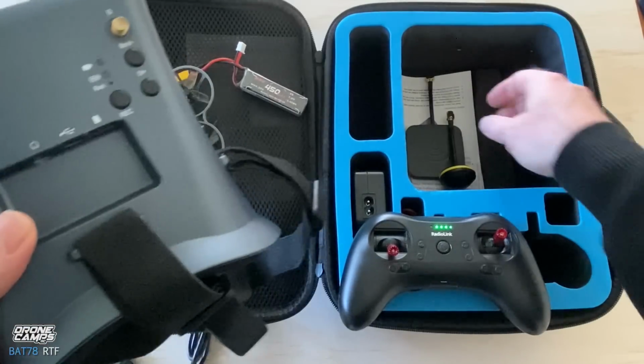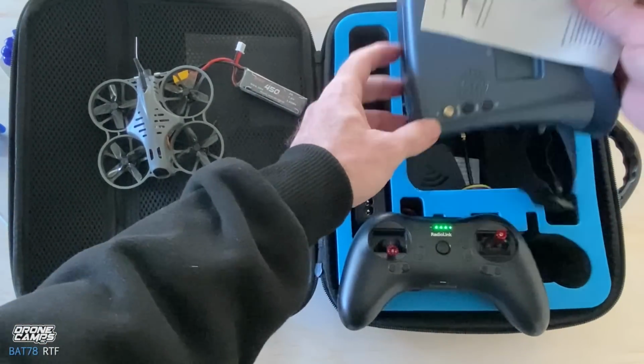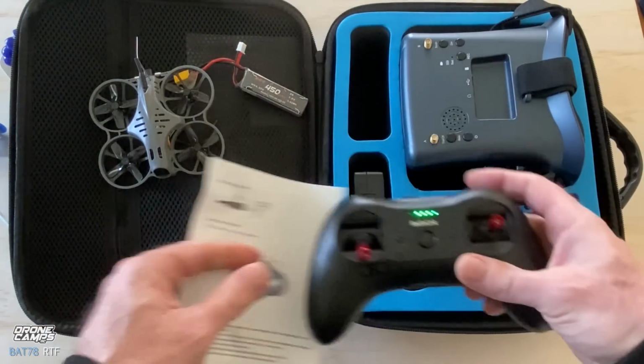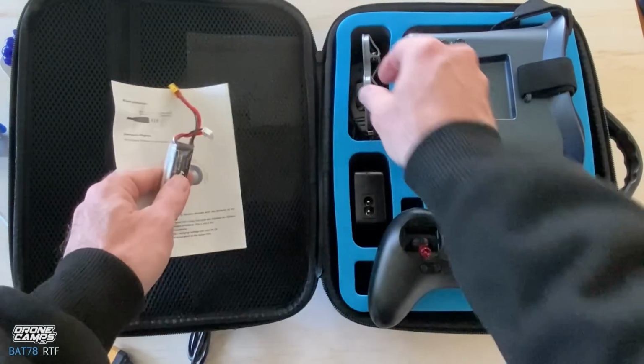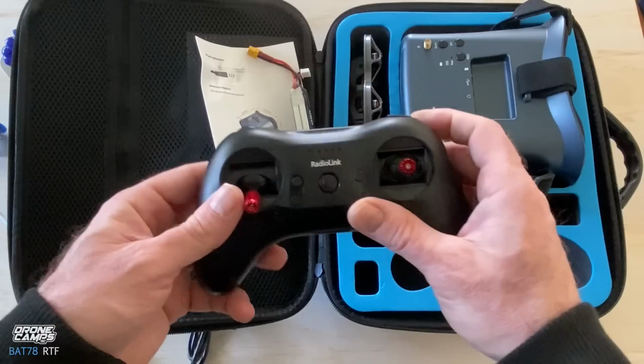If you want to get on a certain band and channel, it should be inside this diagram. And now also guys, to turn the radio off, you press and hold. We're going to unplug the quad first. And the quad fits nicely in there, just like that, or face up if you want. Press and hold there, and you'll see that turn off.